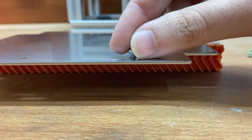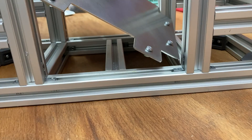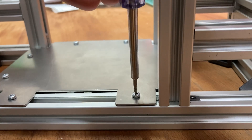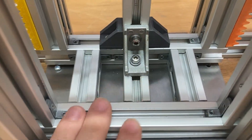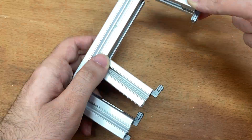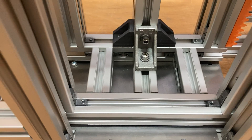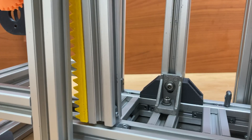I'll use this steel sheet as a base. A theoretical maximum force of 2 kilonewtons will be applied to this surface, and I fix it with M3 bolts and 3D printed T-nuts. Now I've quickly done a couple of things. This is the press surface — theoretically a maximum force of 2 kilonewtons will be applied on this top surface as well as the bottom surface, so it must be solid.